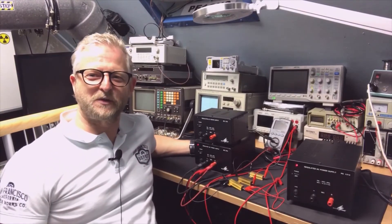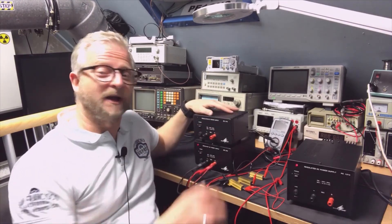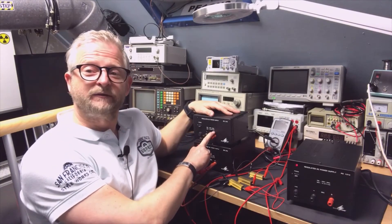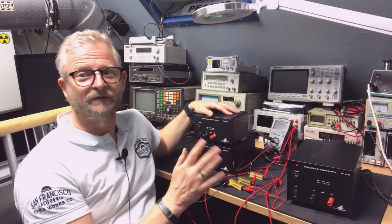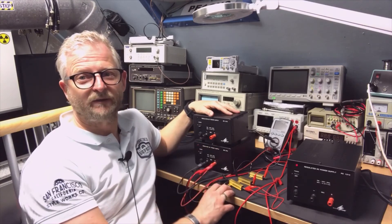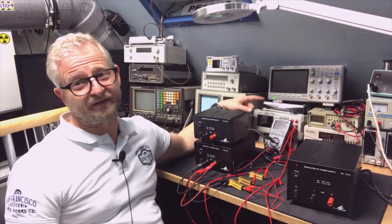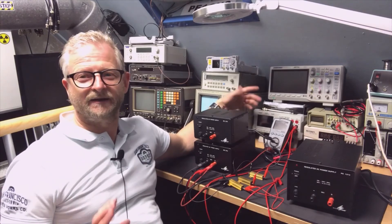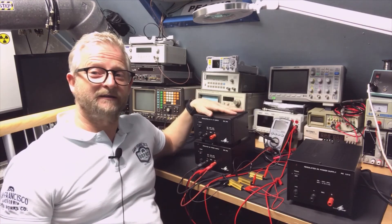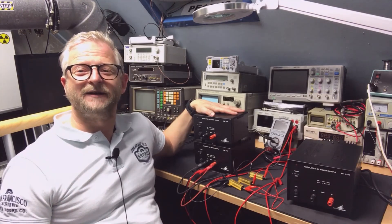So that's it. Thank you for watching — it was a quick one. I'm surprised, especially by the small one. It says 2 amps on the front, 2 to 3 amps with a peak of 4 on the box, and we put resistors as a load and went up to 3.5 amps while the voltage only dropped from 13.8 to 13.6 volts — a very, very small drop. So they actually perform very well. Thank you for watching and hope to see you next time.